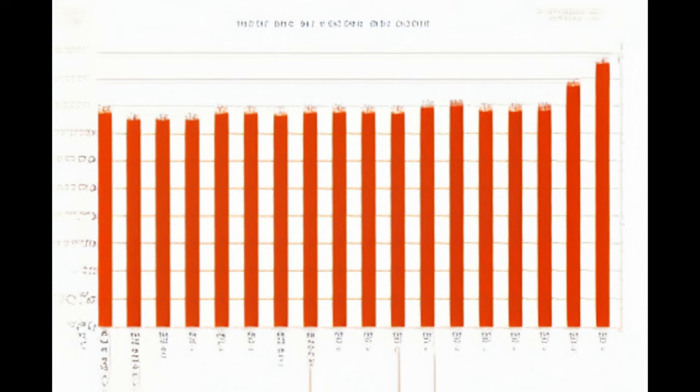The ideal parameters would be constant measurement of product and bottom's alcohol content, but that is difficult and expensive to do. So instead, I have used column temperatures as surrogate parameters. I've worked on two such parameters: the temperature of the bottom of the column, which reflects the alcohol content of the bottoms, and the length of the isothermal section of the column.